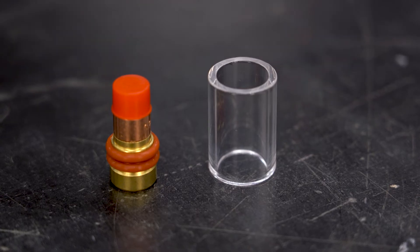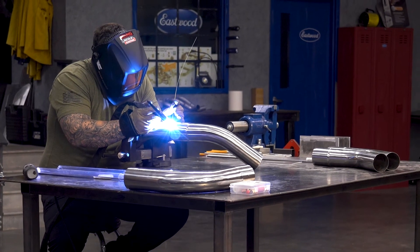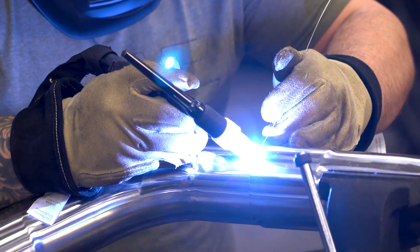For example, when welding a roll cage, it can get tight in some of the major joint areas and be hard to fit the torch where it needs to be — this will help alleviate some of that struggle. Finally, with the exclusive double O-ring design, our gas cup is held on nice and secure. This means you won't have to worry about the glass gas cup and your torch coming apart when you're working or moving the welder around the shop.